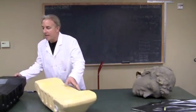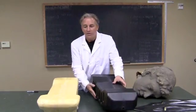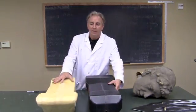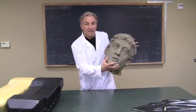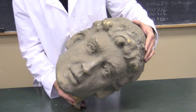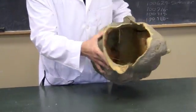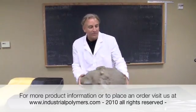In other cases it's used for cavity filling. This is a rotationally molded piece where the urethane foam was molded inside a skin, forming a nice protective barrier. In the art world, foam is often used as a back filler. In this case, a large statue needed reduced weight because it was going to be hung on the side of a building — the three pound foam poured in and rotated around the skin formed an excellent structural enhancer. So you can see it can be used for back filling as well.